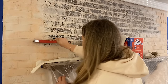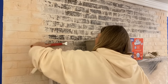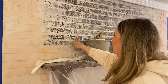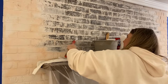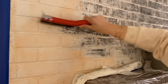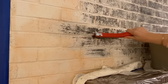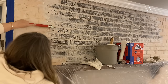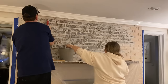Now more is exposed. There's also a steel brush I got at Lowe's — you can see how well that works, and it has a scraper on it too. We're just testing different products to see what works best. I seemed to like the grill brush most, as well as the steel wool, and dipping them in hot water helped remove the paint. At this point the paint stripper had been applied for a few hours and it still wasn't any easier to get off — we still needed to go brick by brick and scrub.